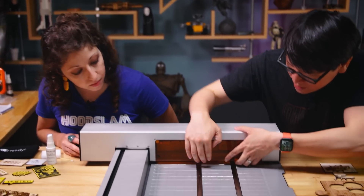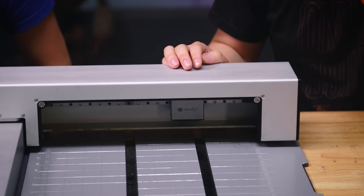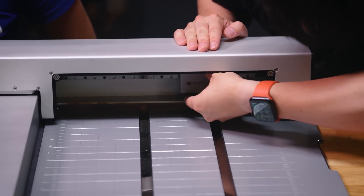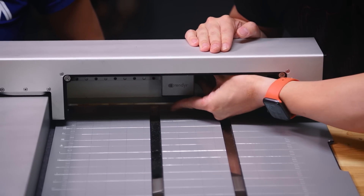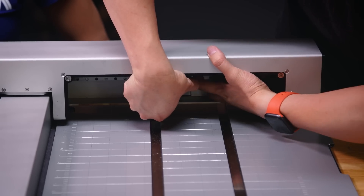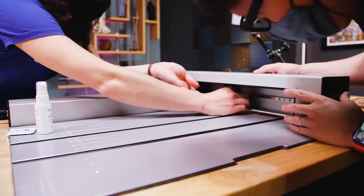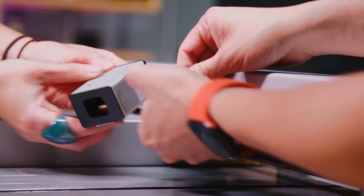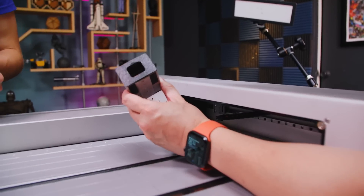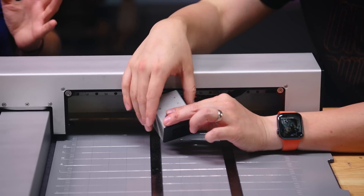As we were working with them and chatting about this design, they refined it and added a second diode. Because the diode is so small, they can fit two inside the head. One diode aims down and one aims from the side, and using a combiner — essentially a one-way mirror — they're calibrated so both focus on the same spot, giving you essentially double the power of a normal single diode engraver. This comes in around 20 watts optical output, about half the power of something like a Glowforge, which is a CO2 laser. Other lasers we've used are generally in the 40-watt range for desktop, up to the 120-watt Trotec we use.